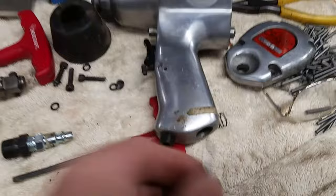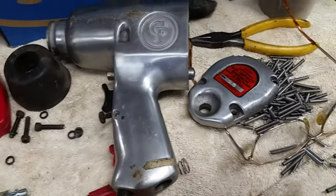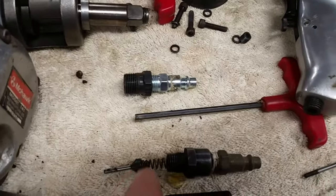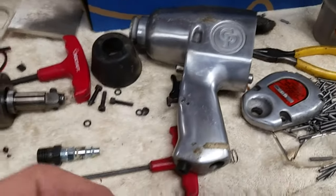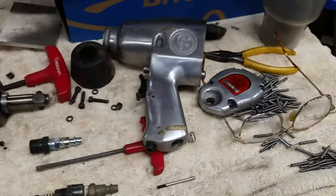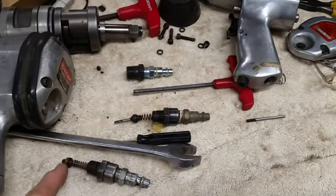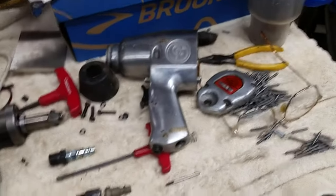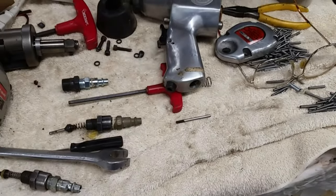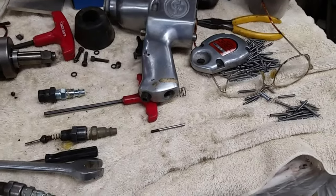What I think this should be, from what I could tell, it almost looked like it was a piece of leather that rotted away. But I'm going to try to make something similar, but with a much longer taper, so that as this gets pushed out, you get more and more air in it. It's not going to have an O-ring. These each have an O-ring on them to seal them up, but I'm not going to worry about that. If I get down to just a hiss, I'll be happy. So that's what's going to get built today.